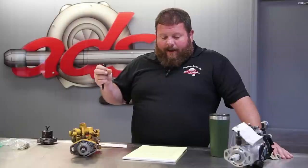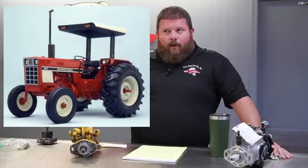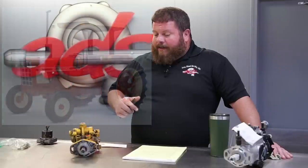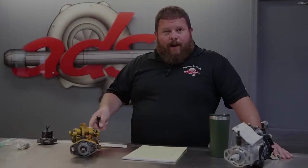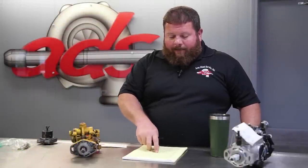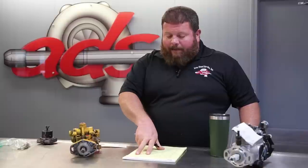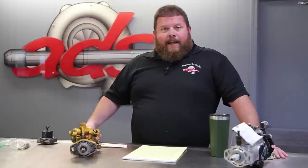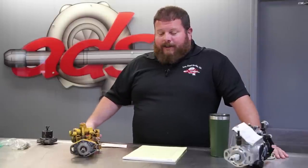This thing is powered by a D268 German diesel, much like you would find in 684 and 784 International tractors from the same vintage. Same setup — German diesel, VA pump. This particular engine is 268 cubic inches, that is four and a half liters or so, rated at 77 horsepower in this application. Circa 1980 would be my guess on this machine.